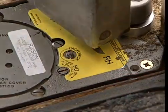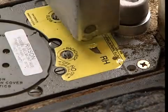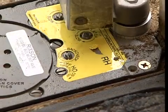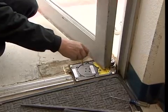This floor closer is designed to stop at 105 degrees. It should begin to slow down its open beginning at about 90 degrees. Make sure you never fully close the back check valve, since this will cause excess pressure on all of the seals in the floor closer.